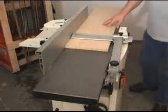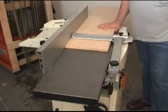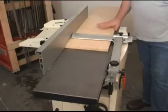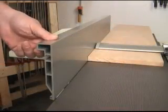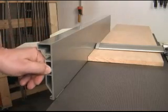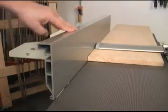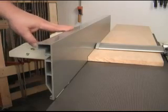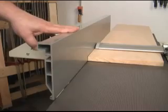At 55 inches long and 12 inches wide, the joiner table has more capacity than you're likely to see in a small shop with any other machine. The extruded aluminum fence is 6 inches tall and 43 inches wide. You can see it's relatively thick walled. The fence is adjustable to 45 degrees outwards only and can be adjusted to any place on the table, giving you all the flexibility you need on a joiner.